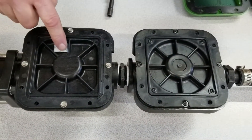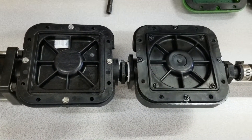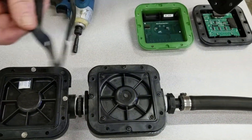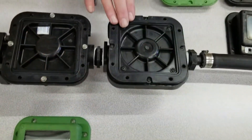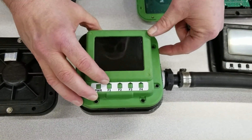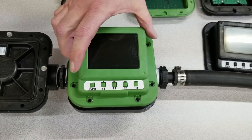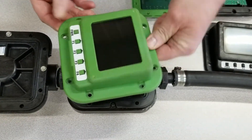If it does come with a little silica packet in it to keep moisture out, leave it there — it's not going to hurt anything. Inside your meter will be a gasket similar to this one. What you want to do is take a soft cloth and wipe any dirt or moisture off that. We are going to put that back on and reinstall it with a new meter. Keep in mind that these meters can go on in any direction that works for you — just because it came off in this direction, you can still do it this way, this way, or this way. Whatever works best for you.